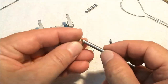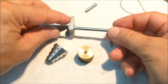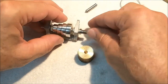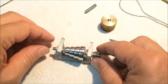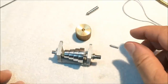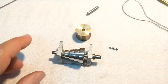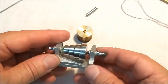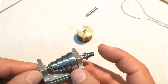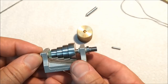Just for the sake of showing you the spindle — because this came out really nice. And because of that assembly sequence: if you were to key this gear with any type of keyway — square, round, half-round pin, woodruff key, whatever — it would have to be slotted full length, or you'd never get it together. This is a very unique little setup. I made a brass washer for the back of the spindle. I increased the diameter of this so it's the same size as the back of the chuck and the back of the faceplate.